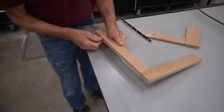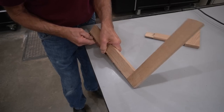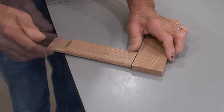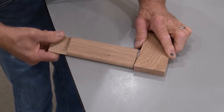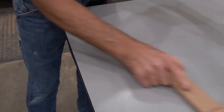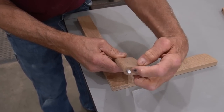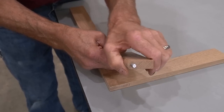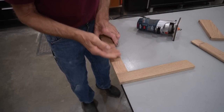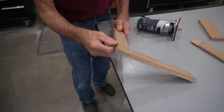With the new design, the back edge of the arm needs to be rounded so it can pivot from the flush position to the extended position without square corners rubbing on the wall or the side piece of the drying rack. I use a five-sixteenths-inch roundover bit from both faces of the support arm to put a five-eighths-inch — or five-sixteenths-inch radius — bullnose profile on the back edge of the support arm.